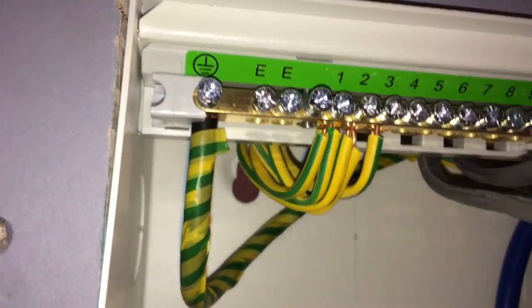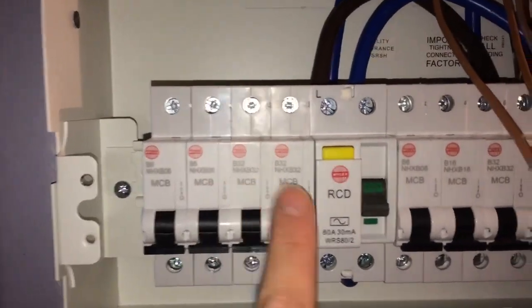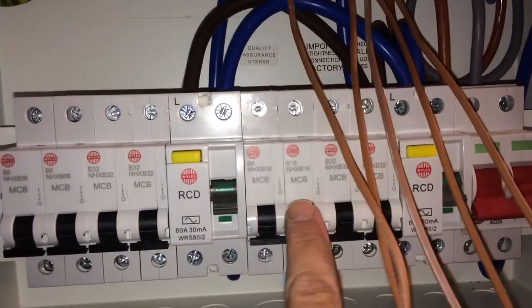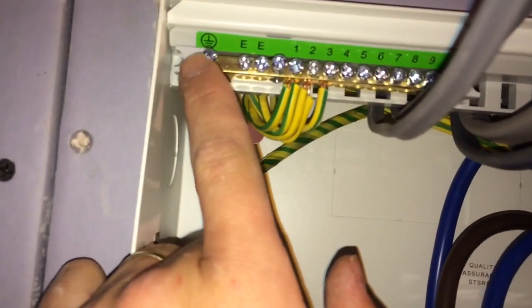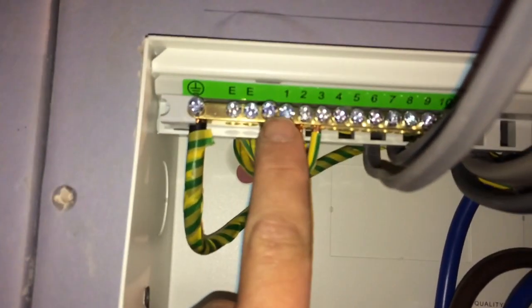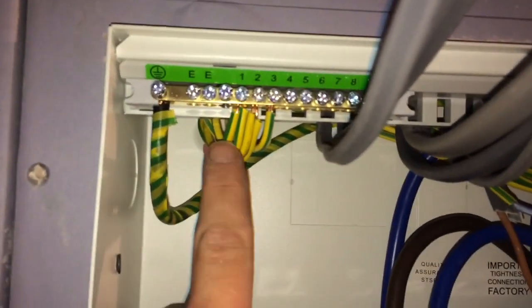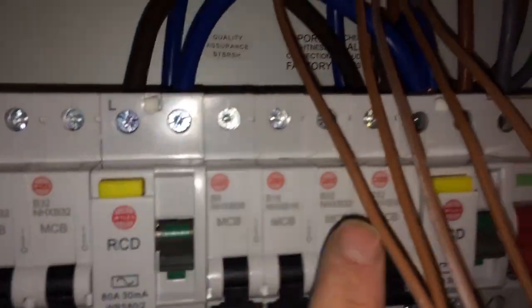Just a quick note: if you read this board from the main switch, you read right to left on this one. But some boards have the main switch on the other side, which you read left to right, and the first breaker will be one, two, three, four that way. On this board it goes one, two, three, four the other way. So the neutral bar corresponds accordingly. The earth bar is actually starting from the left — there's your main earth, water and gas bonding, and then you start with your circuits. On a split load board you have two neutral bars.